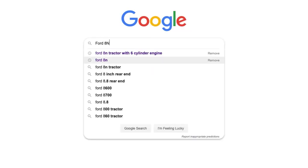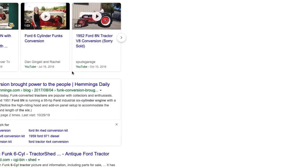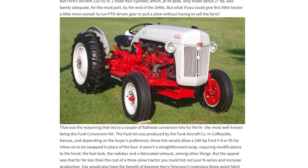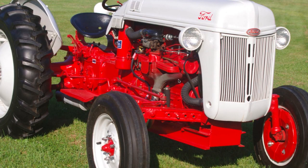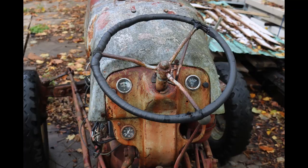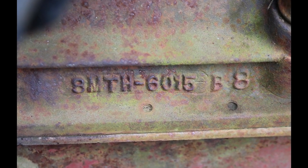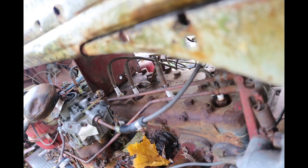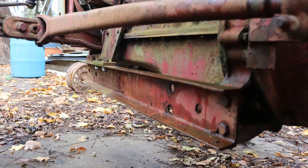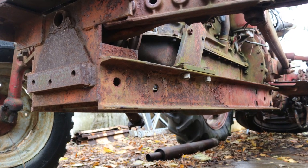When I got back home, I did a little bit of Googling, searching for a six-cylinder engine in a Ford 8N tractor, and found out about something called a Funk Conversion. Basically, two brothers that ran an airplane company designed a kit for the 8N that would adapt it to a six-cylinder industrial Ford engine. Later in the day, I got a phone call back from the owner of this tractor, and she confirmed that she and her dearly departed husband had gotten this tractor from some folks who actually did this conversion back in the day. So some of the welds on here look like they're done by a farmer, because this was a conversion done on the farm rather than at a dealer on a new tractor. It definitely has some very interesting history, and it would actually work better for an electric conversion than one of the standard 8N tractors.